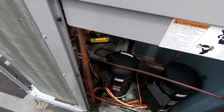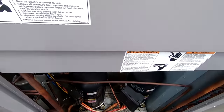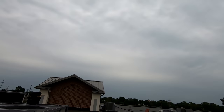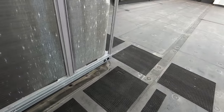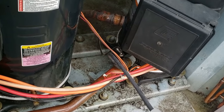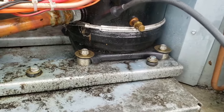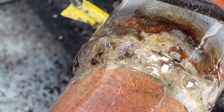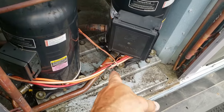You can see there's oil down on the bottom there — not sure if that's new oil from a dryer or old oil from before. Worst case we get it charged correctly and if it starts to rain we'll come back and finish it up. This one holds 43 pounds so we're not quite to our target yet. We're going to look for a leak — right down here on that solder joint every time. Surprisingly, there's nothing leaking on the seal here, nothing there at all — wait, there are microscopic micro-bubbles. There they are. Going to douse that down again.